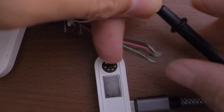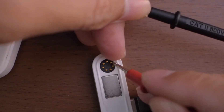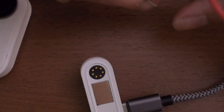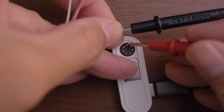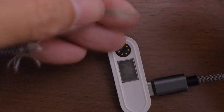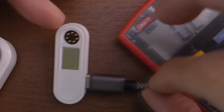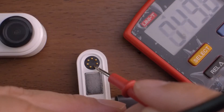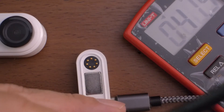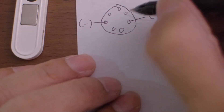White cable confirmed on its pin. For the green cable — wrong first guess — after checking with the ohm meter, the green cable maps to its correct pin. That concludes the experiment. The Caddx Pinup / Insta360 GO 2 pinout is: plus, minus, button, and then RX/TX for USB data.